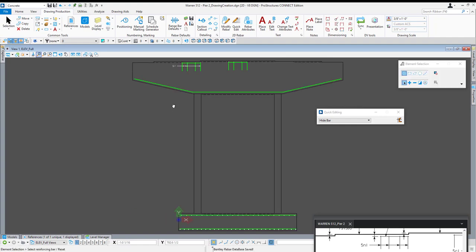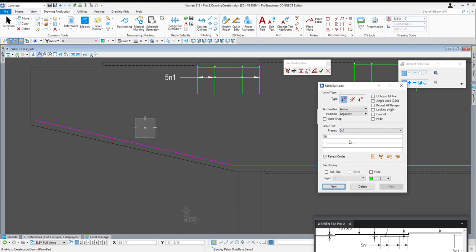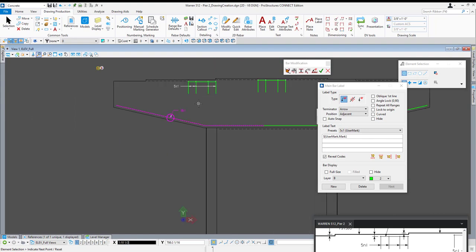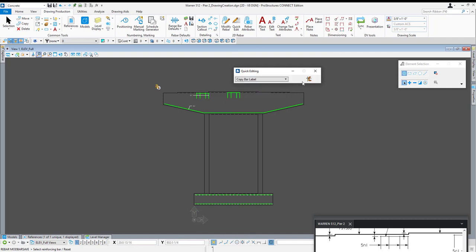Just a heads up on that feature. I'm going to come back to my label and maybe give it an arrow just to add a little bit of zazz, then accept. Now we're ready for our beam reinforcement. One note about the beam: whenever you have a lapped set of reinforcement with user marks applied, the program is appearing to have a little trouble identifying which element to get the user mark from. So I've actually added these to the beam as separate bars — identical in all dimensions, just once as a left bar and once as a right bar — removing the lap logic so I can place my callout and continue on to the bottom bars.